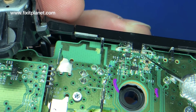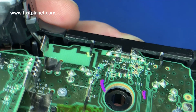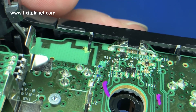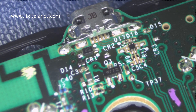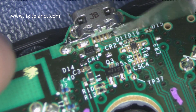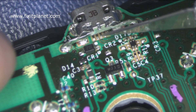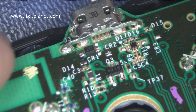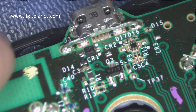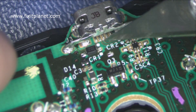So we can definitely see these pins are lifted up and loose. This is a fairly typical repair — we get lots of these kinds of things. All sorts of devices use that particular connector. You can see those are definitely loose. There are five pins and all of them are loose, and there are a couple that have lifted the pads. That third one from the left, right in the middle there.